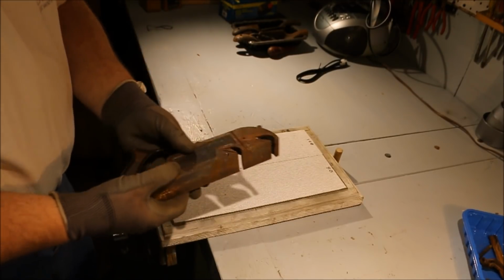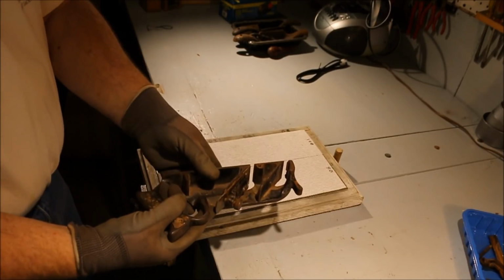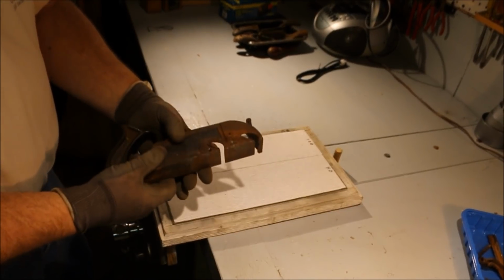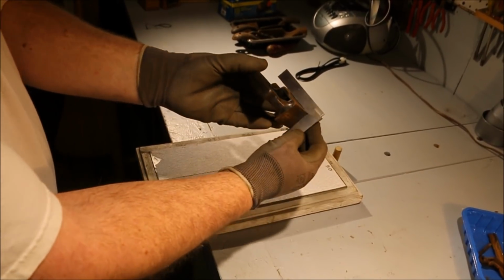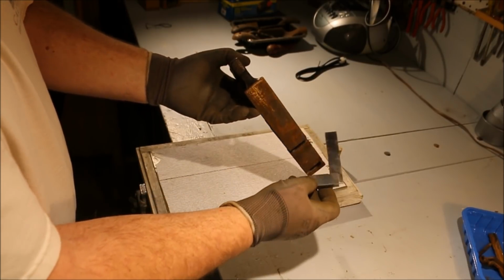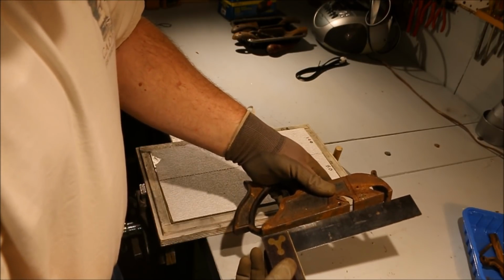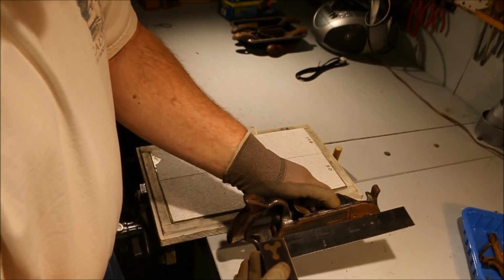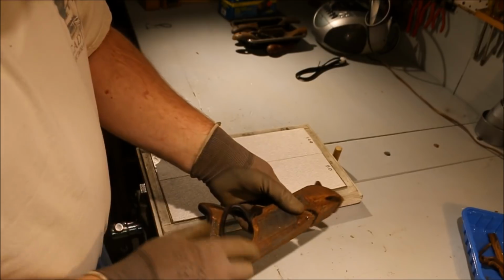just the bottom. Then I'll take out the nicker and the blade clamp, and I'll flatten this side just slightly. Doesn't need to be a whole lot. I'm mostly just cleaning off the rust on this. I want to end up with this straight and square like it is right now. So I don't want to take off a whole lot of material, I just want to clean up the surface. Since the goal is to have everything straight and flat, and this is already straight and flat this way, and straight and flat that way, no need to take off anything more than I have to.